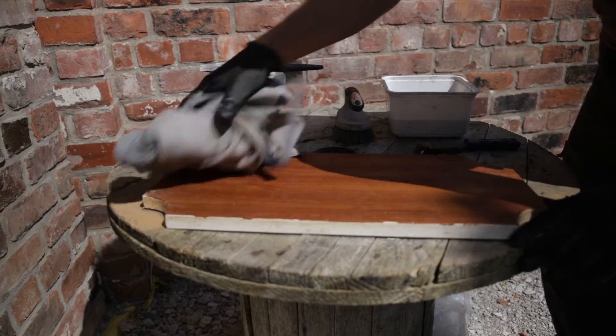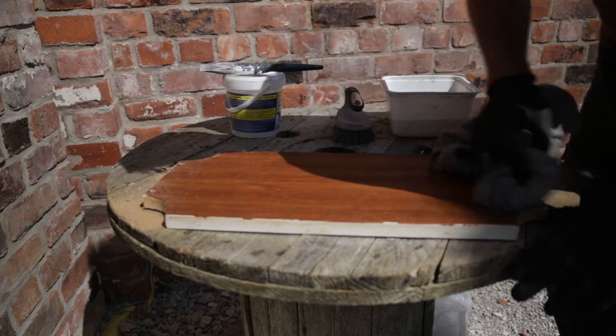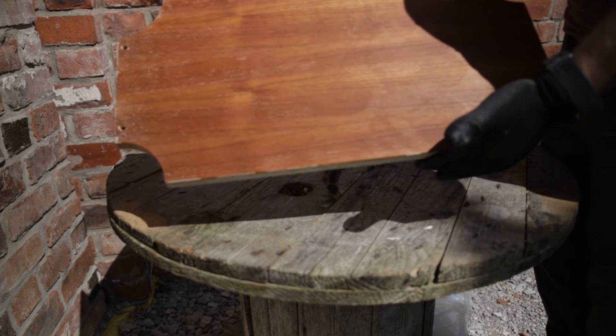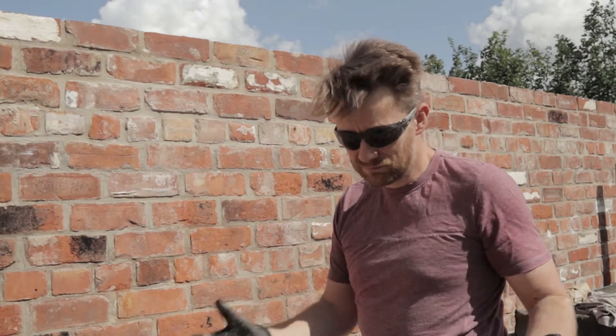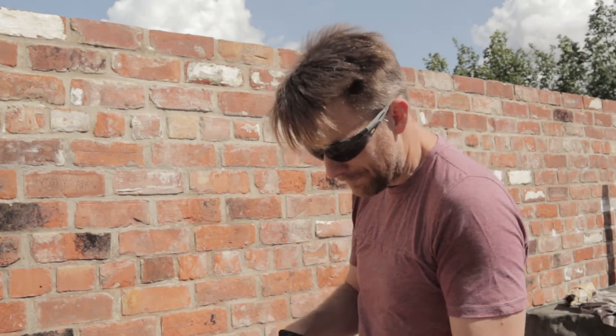Yes, I know that's not perfect — but that's a damn good start away from where we were. We've gone from that to that. What we can do is give that another scrub and work some more into it. It's at this stage taking the paint off but left the original stain or finish on it. We could go further and let it work the original finish off. So that is how we've found this more eco-friendly paint stripper — a nice alternative.